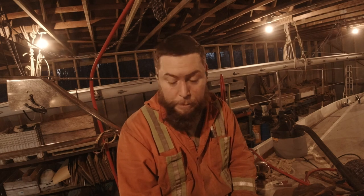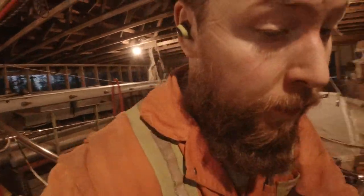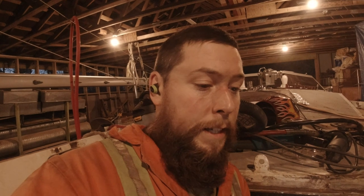It's not the prettiest, but man is it hard to weld that. That was not fun. I mean, you can see I'm not a super good welder, but I make do. So you can see where I could reach it all looks not too bad. You can see my starting stops — this is kind of messy, pretty ugly-looking welds. This is the first big uphand I've done with MIG. I'm just gonna have to get better at it. This will all be ground from the outside, veed out, and welded from the outside, so hopefully I can get a better-looking weld out there.